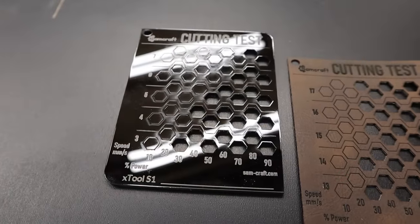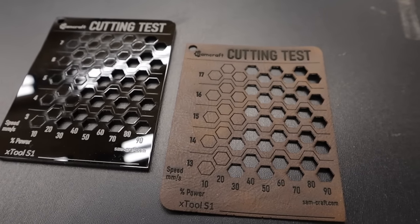For the laser wool leatherette — the hat patch material I engrave, cut out, and apply with a heat press — I got wonderful cutting results, as fast as 17 millimeters per second at just 60% power. I would probably run this one around 16 millimeters per second at 75% power just to ensure single-pass cuts. For engraving the laser wool leatherette, anything around 500 millimeters per second at 50% power did really well. But that does vary based on the color or finish — whether your material engraves to black, silver, gold, or something else. That's one of the places where engraving tests really shine and will teach you the benefits of different settings.